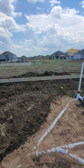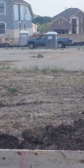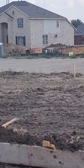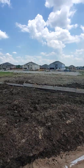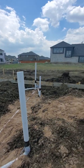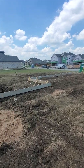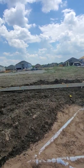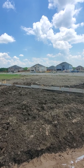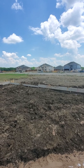Right over there you can see some pads being built where they're going to build more — that's kind of what it looks like when you build a pad. You want to get it flat, and make sure you have good drainage. Without enough drainage, after rain it's sloppy, mushy, holds water, and crawdad holes are everywhere. But if you have too much drainage, all your dirt washes off and you can't get grass to take hold.